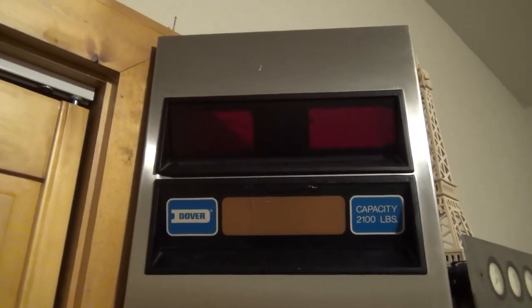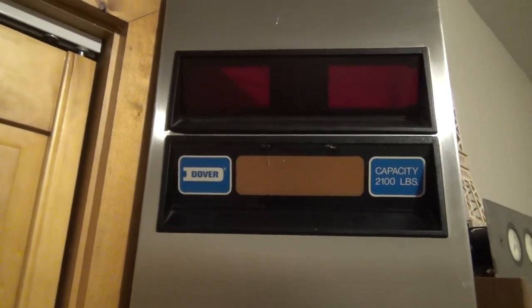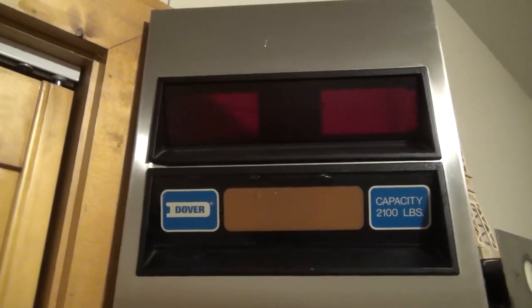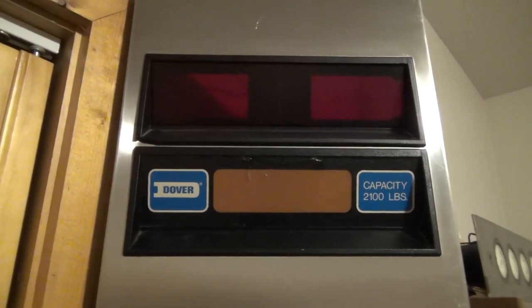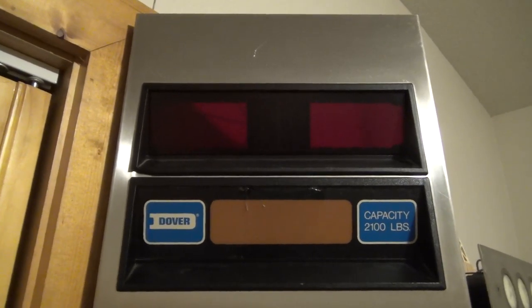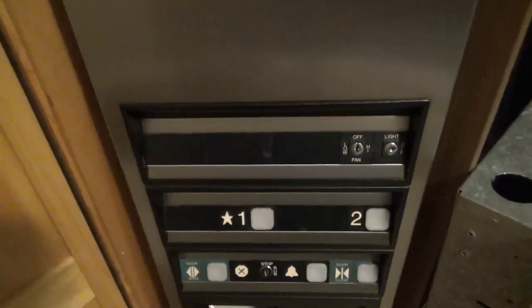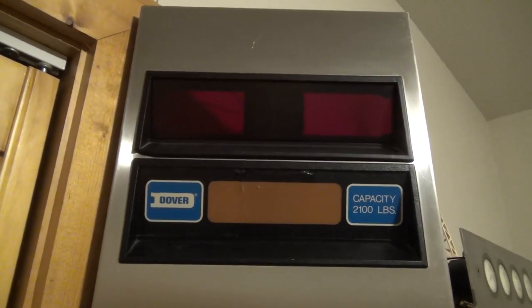So what went wrong? First, we were going to run the whole thing with one nine-volt battery — the Arduino, the buzzer, everything. That's a lot for one nine-volt. So I decided to break it into two nine-volt circuits — one for the lamp and buzzer, one for the Arduino. Well, that didn't work either because the nine-volt still wasn't enough. The big problem was the relay, because I used a relay to activate the alarm, and that relay was drawing too much power and would shut the board down. When plugged into my computer it would have enough power. So what I've ended up doing is using this power bank to run the Arduino — and conveniently it's a Midwest Elevator power bank, so thank you Midwest Elevator for the battery pack.